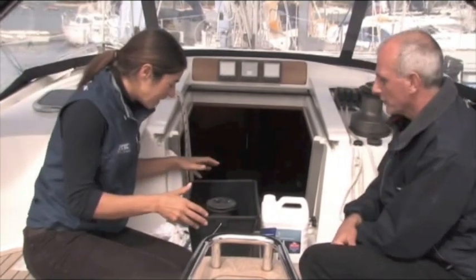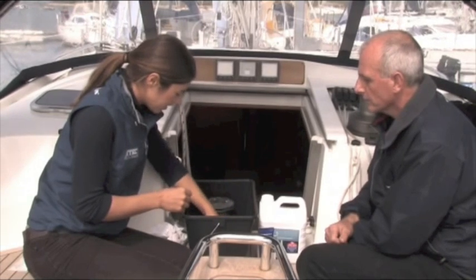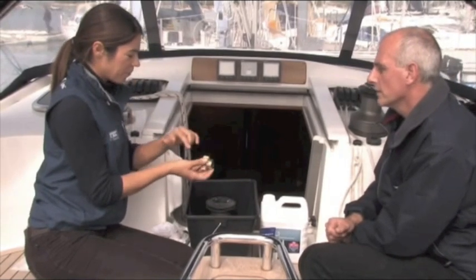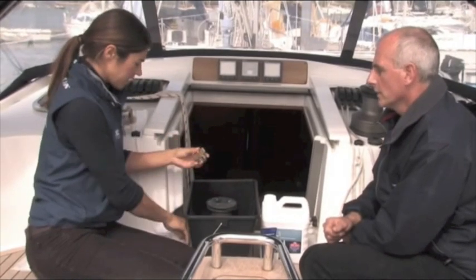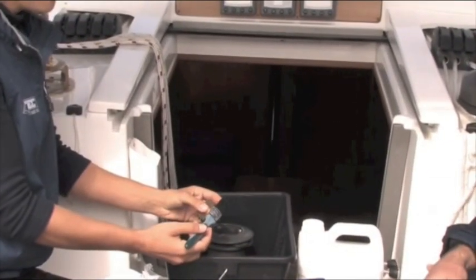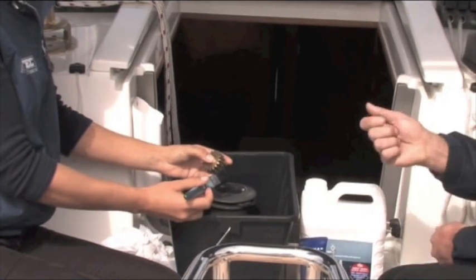Otherwise you'll be leaving it in bits and tomorrow is obviously another day. I usually dive in and clean the trickier parts while I've got the enthusiasm to do so. They tend to be the gears with all the teeth — it gets quite dirty inside there. It's worth putting all the parts in the bucket and soaking them in white spirit, as that softens the grease ready for using the brush and getting all the hard grease out of the gears.